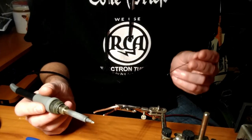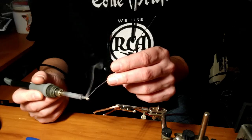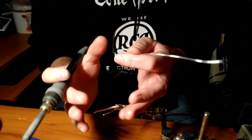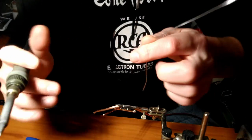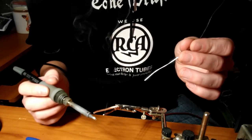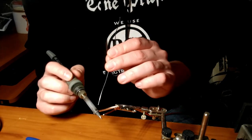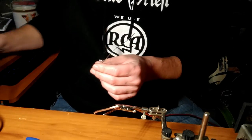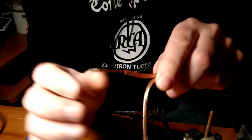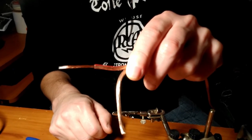When you're soldering, what you're not doing is blobbing melted solder onto the components you're soldering. You want your tip tinned a little bit, because you'll have a little bit of liquid solder on your tip, and when you press that against the thing you're soldering, that'll wrap around a little bit and help spread the heat around. Then, for instance, here we're heating the item we're trying to solder, which is the speaker wire, and then introducing the solder onto the heated speaker wire. We're not blobbing it onto the tip and then smashing it up onto the speaker wire. You will have very poor results if you do that. But there you go. This is what we got. It's just the first quarter inch of the wire that has been tinned.